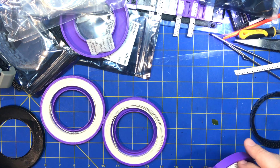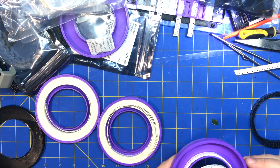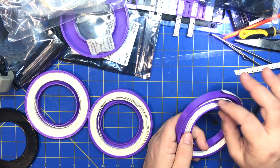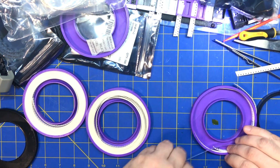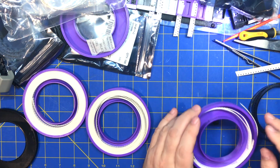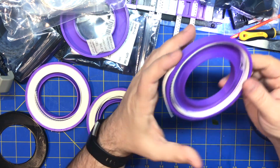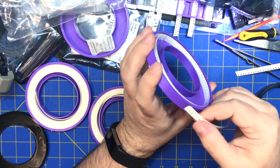When you're dealing with paper tape, you really can't kink it beyond a certain diameter, or it starts to crease. And when it creases, the plastic comes off, and then you start getting parts falling out, and it just bends the paper and gets all kinky like this. So right now I'm just trying to unbend it so that it goes to the outside. But if you took it off a reel, it would want to naturally snap to the outer edge because of the diameter of the reel it came off of. I guess I should have looked at what diameter reels come in, but it doesn't really matter. I was more interested in keeping it flowing smoothly when you try to extract it, and keeping from creasing. Here I'm just testing paper with a piece of plastic compression.